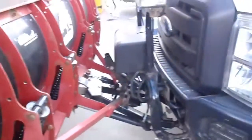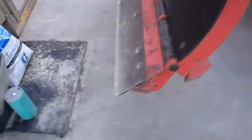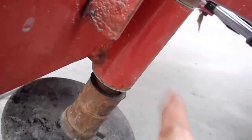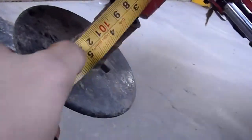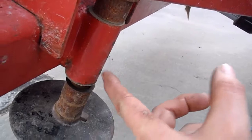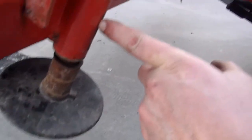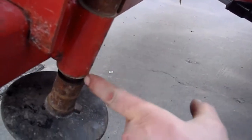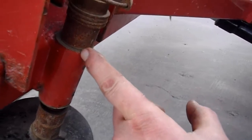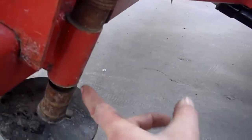Here's the plow on the front of an F-250. I like this plow because it's got a trip edge and a poly moldboard. Here are the skid shoes that are on it — the shim system has some washers and pipe spacers. The skid shoe measurement is three and a quarter inches. So I've got my measurements and I'm going to build a mount so the caster wheel can sit up a couple inches higher than the skid shoe, mounted on there with a pipe.